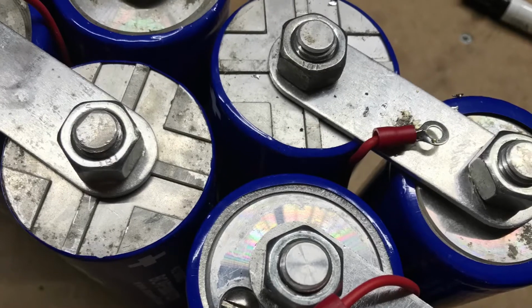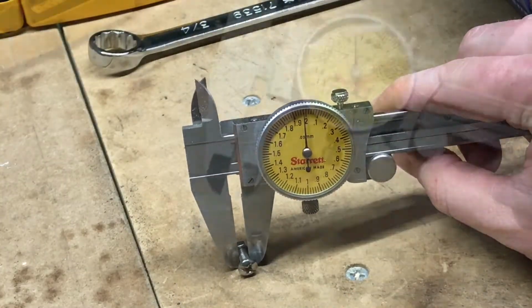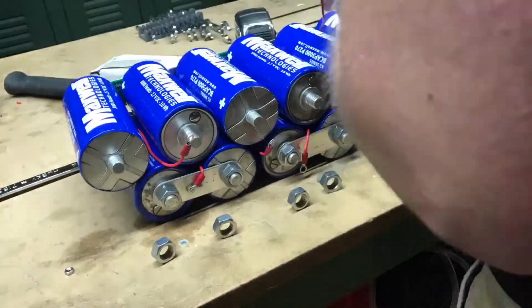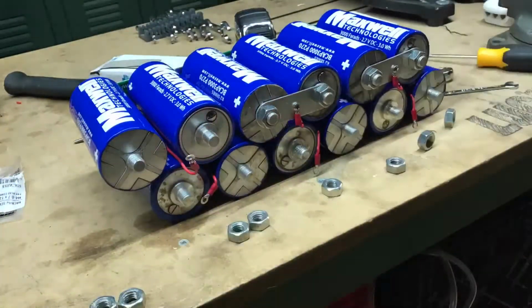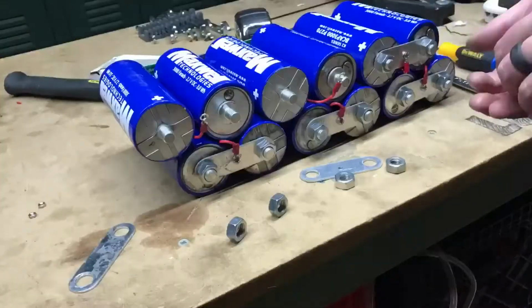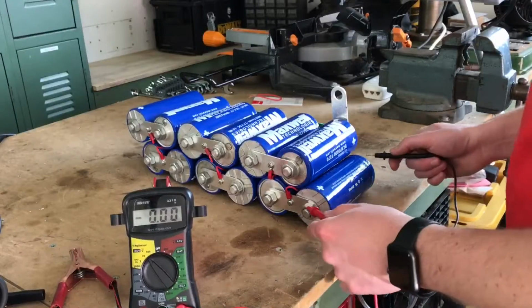The other end of the wire we just soldered to each of the balance boards will connect to the aluminum strapping on the opposite terminal. You can choose to solder these wires to the strapping, but I've chosen to crimp an eyelet onto the wires and attach them with a screw. After drilling holes in all the aluminum straps and connecting the wires, I began to connect them to the bottom terminals. I think this might have been my 32nd try at getting it so that I did not have these wired incorrectly, so you're going to want to make sure that you're really careful when you do this.